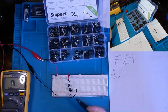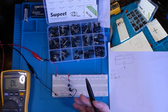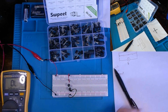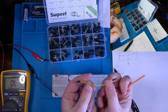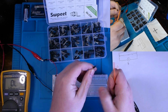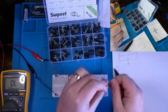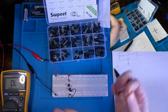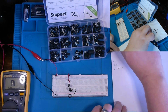Now, first off, what is the purpose of an inductor? Well, or actually, what is an inductor? Let's discuss that first. Essentially, what you have is a conductor, such as a copper wire, typically enameled, that's going to be wrapped around a ferrite slug or core. Something like that is a demonstration, although this is a Q-tip and not a ferrite slug or ferrite core.